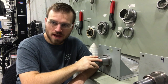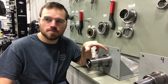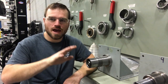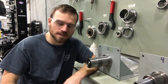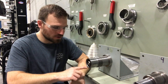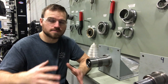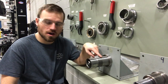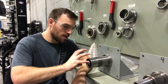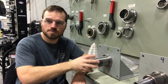This is one that we would typically be using in our bearing installation labs — this is shaft number three. This one kind of has everything that you're going to see. You're going to have flat spaces, you're going to have threaded spots, you're going to have internal bores, you're going to have tapers going into those internal bores, or even a taper going on to an external shaft. So you want to inspect all of those. On all the flat surfaces we're looking for any type of gouging, any type of wear, any indication that the bearing has spun on the shaft and created damage.